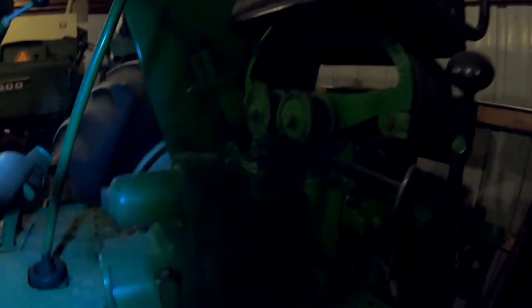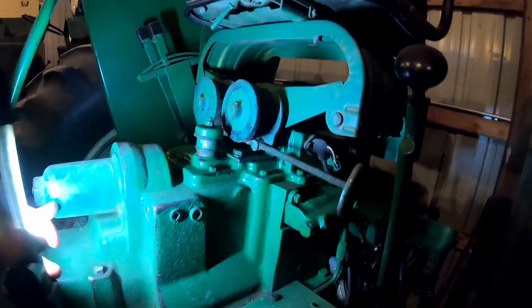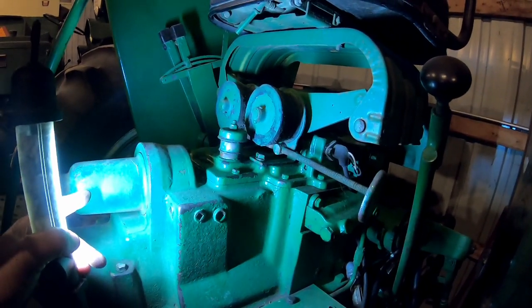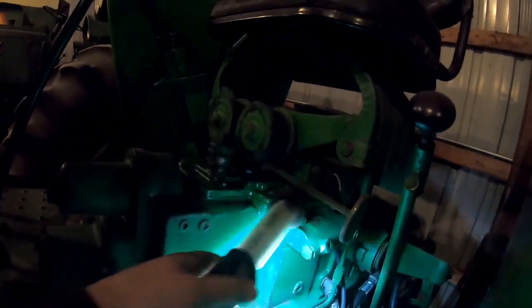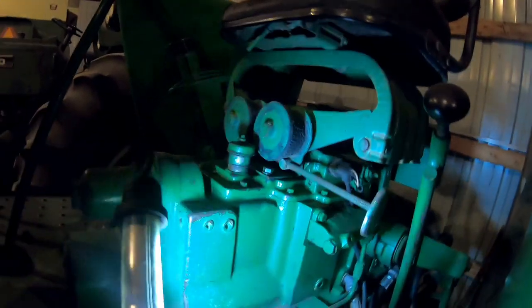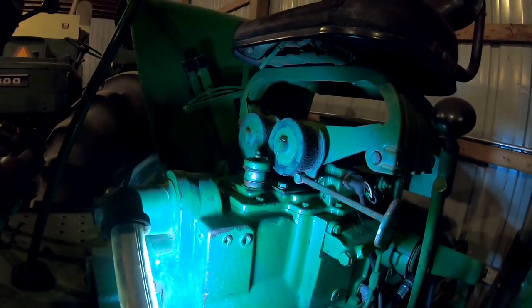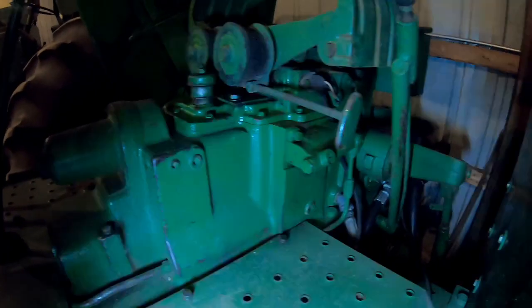The C series is more like the 50 series as far as the path of the oil. The oil gets filtered first thing, other than the relief valve, so that's much better. But they didn't do anything in the cover to make provisions, and they didn't put the bolt or the taps in for power beyond. They do have a zero-pressure return port down there and down here.